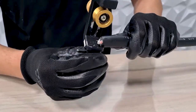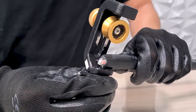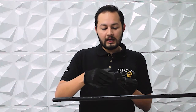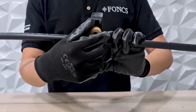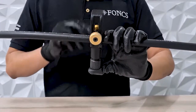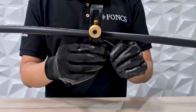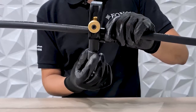Make sure that the depth of the blade isn't deeper than the thickness of the outer jacket, so it doesn't come in contact with the fibers. Retract the blade by loosening the knurled knob and locate where the first slit is going to be performed on the cable. Loosen the golden knob, adjust the guide wheel onto the cable, hold the guide wheel, and tighten the golden knob.